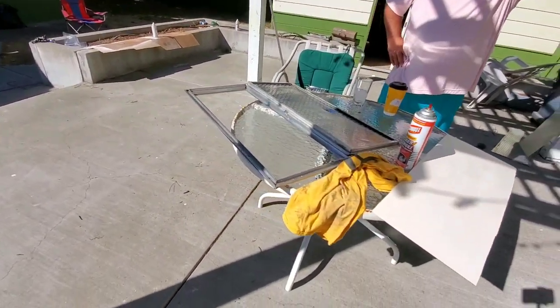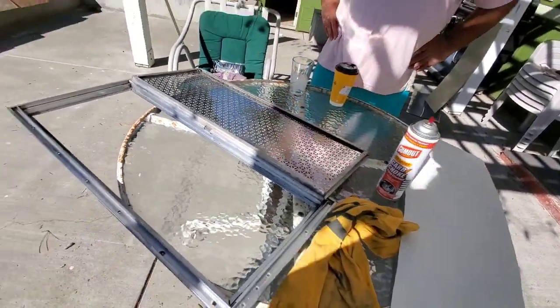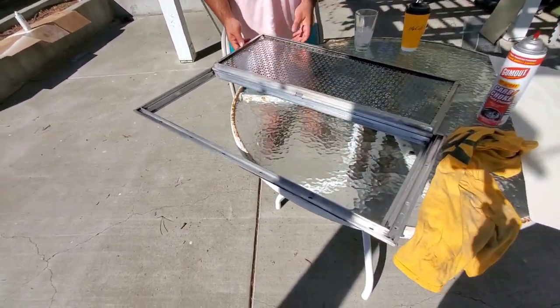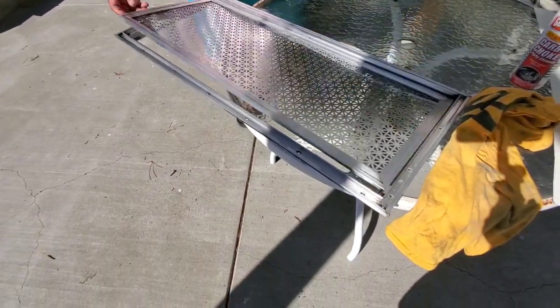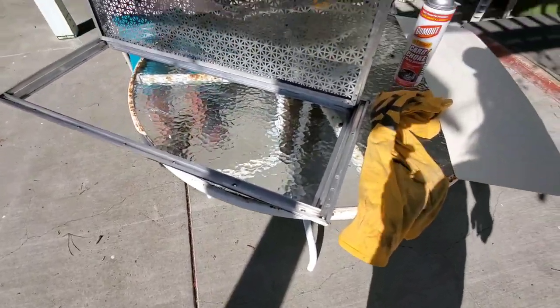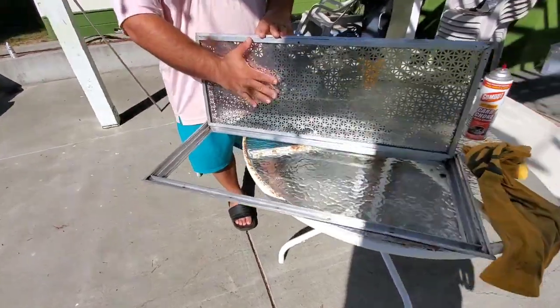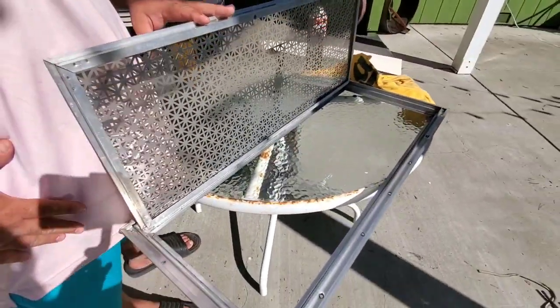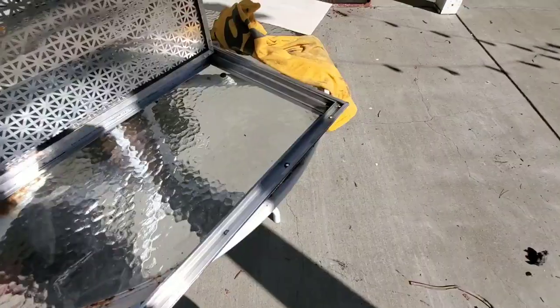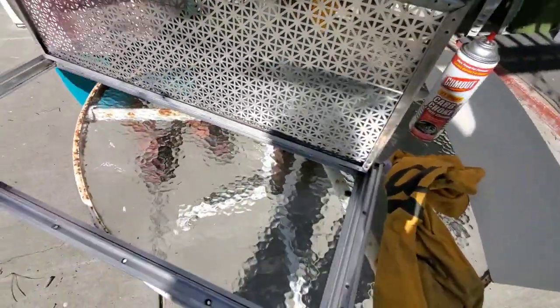We're at progress today. That frame is really cleaned up good on both sides and it's able to accept the adhesive. Rosie cut this piece and put it here for the face of the generator door — it looks really nice. We're going to fit the showpiece behind there, and then get in there with the butyl tape and work that butyl for a really snug, tight fit. We're going to put butyl tape here and seal this outer door with the sheet metal. There'll also be butyl tape there for another seal, and butyl tape and seal underneath the frame as well.